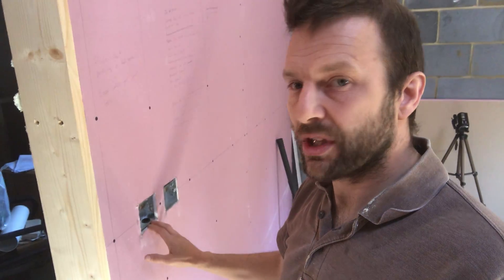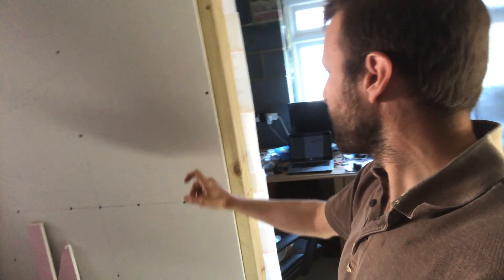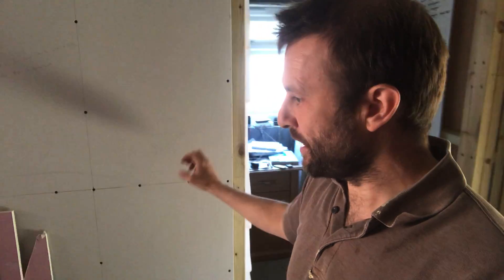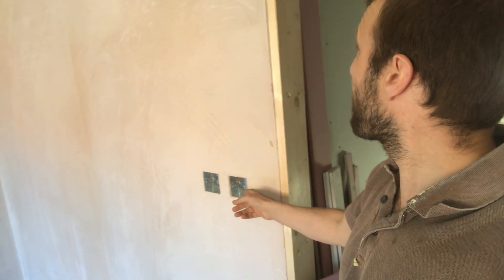So I'm going to feed this to the first floor. I'm going to feed this switch. That then comes to - there's going to be a switch here which should be back to back with the bathroom. Actually it won't be, because the bath is going to be within 600. So this will be the bathroom switch and the hallway switch. And then from here it comes to this bedroom switch. And then from here it's going to run upstairs to another switch - there's sort of a little mezzanine floor that I've built there.